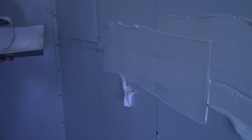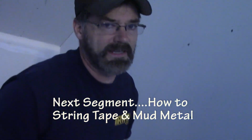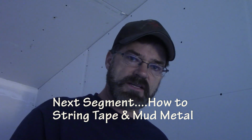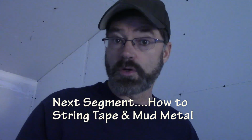So you may find that you want to pre-fill that, and some cases are worse than others, just so when that gets the tape on there, it comes out a little bit flatter and smooth. Then when you tape that, it's going to be better. You're not going to have to work that ledge out. And sometimes don't worry about it, but if it's bad, go ahead and do a pre-fill on that so it makes the taping easier. And then by the time you finish the joints, it's going to look like a joint should look like.